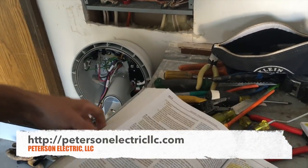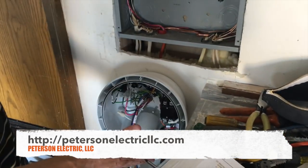You also have to look at voltage drop. From here to here, nothing. Even if you went 100 feet, I wouldn't even consider it. If I was at 150 to 200 feet, I'd consider it a voltage drop and step up one wire size.